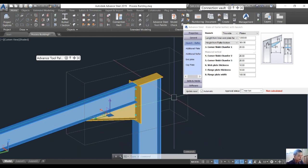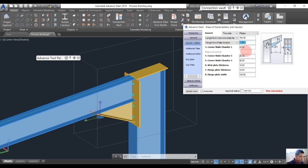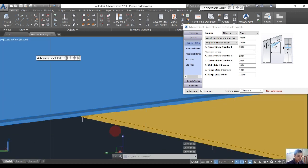We will modify the length of the haunch here. Number 1 is the length of the haunch from this point to this point. I want to change it from 1200 to 700 mm. Number 3 — I want to change that to about 250. You see that's number 3 here, and we check that.